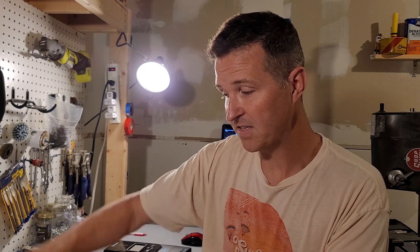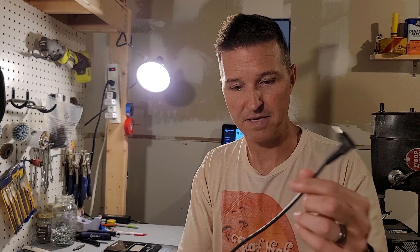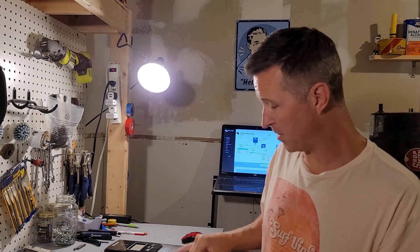What I believe I can do is — here's the plug that goes into the laptop — I'm going to cut it right here. I'm hoping there are just two wires in here; it says it's 16 gauge. I'm going to put ferrule tips on them and plug them right into the PV plus and minus of my solar charge controller, then hook up my battery, plug it in, and we'll see what happens.